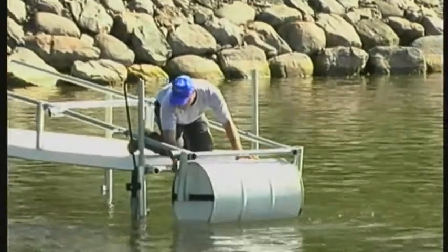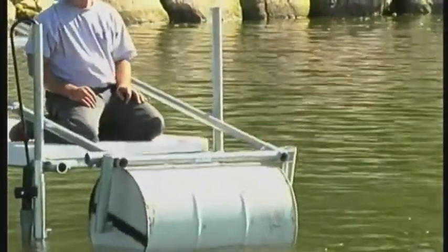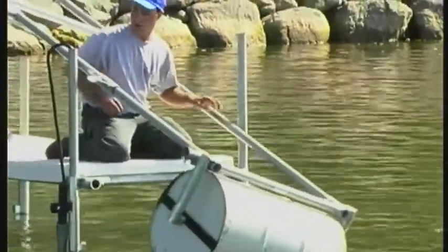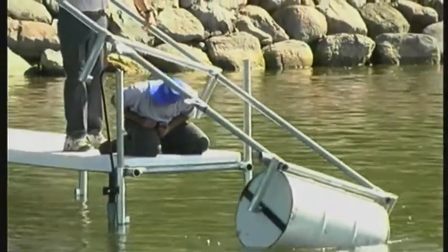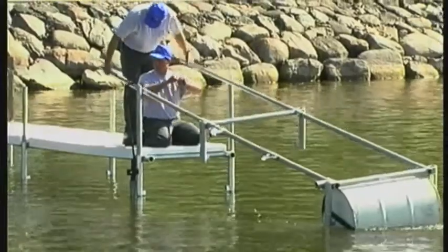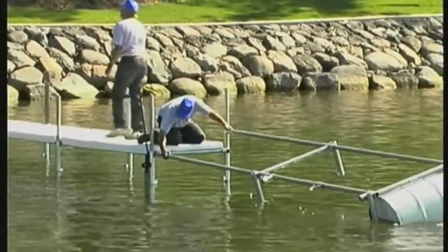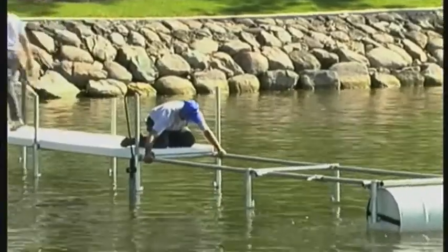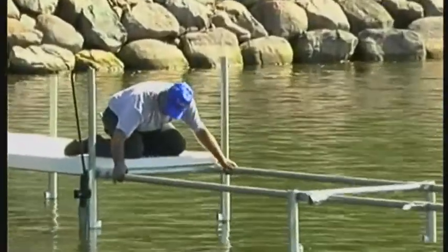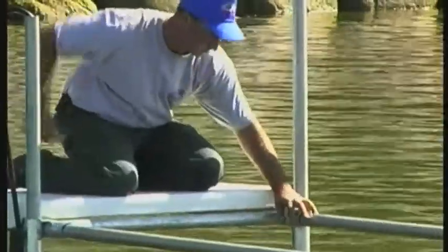Put the barrel into the next framework using our suggestion of pushing down the open end of the frame pipes to raise the bracket. As you insert the next set of frame pipes into the previously installed frame, it is important that you listen and feel that the new frame pipes have made contact with the existing frame pipes inside the sleeves. You will tighten one frame pipe in the sleeve, then as you are tightening the frame pipe on the other side, you need to hold the pipe in the sleeve as you are tightening it, to ensure it is secure against the other pipe inside the sleeve.